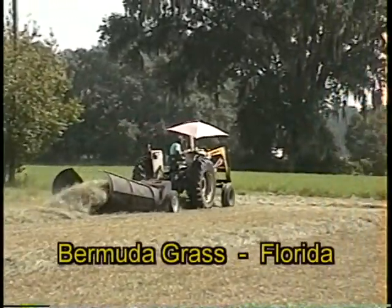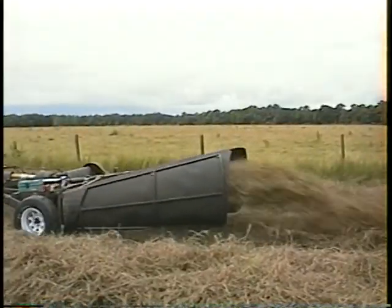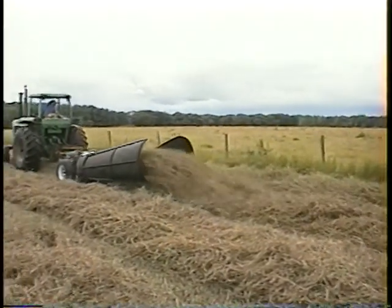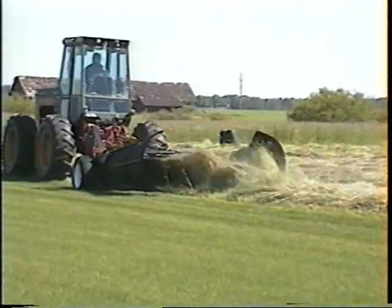Grass hays tend to be tougher to dry than alfalfa. The stalks are much harder and have a waxy surface. Ordinary conditioning rolls have trouble getting them opened up. Even when you cut with a mower conditioner, grass hay tends to form a thatched roof situation. This really limits airflow and slows drying.